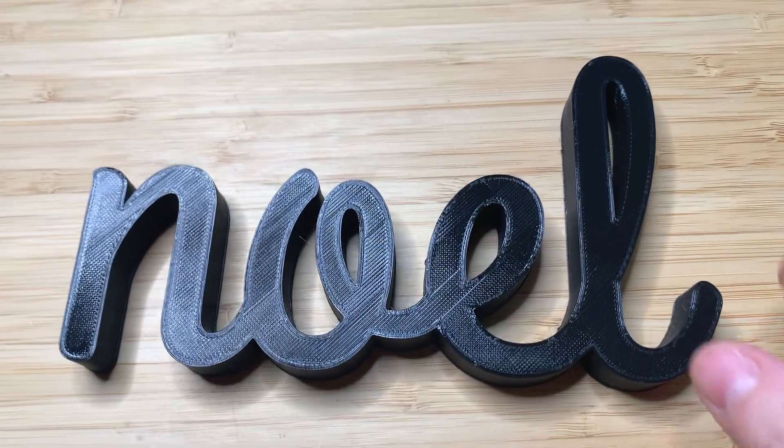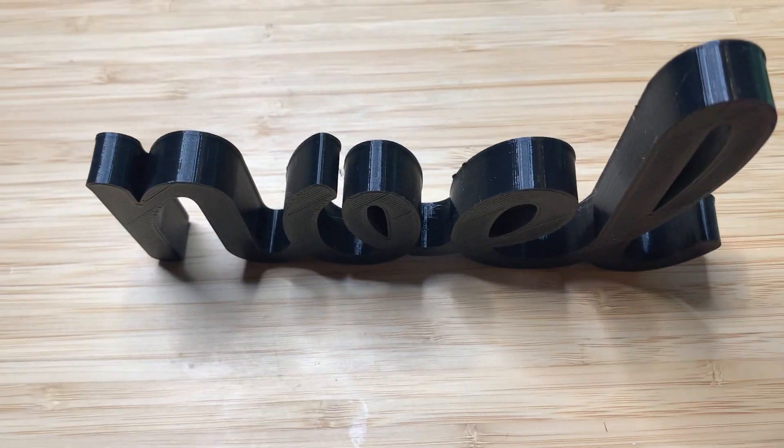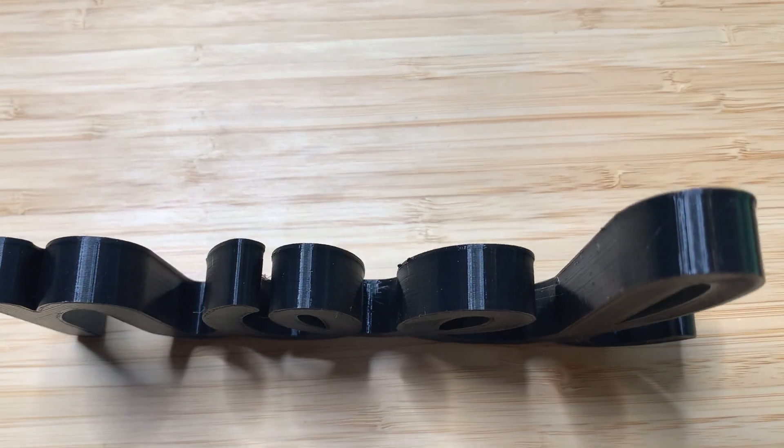This will eventually pop out and will probably sit backwards. The idea is for it to sit in the bottom of a Tupperware or sandwich box — or I might make my own box out of acrylic — stick it to the bottom, and then pour the silicone over the top to create the mould. I'll leave that to set for a day and come back and check it.